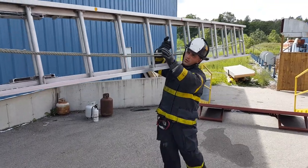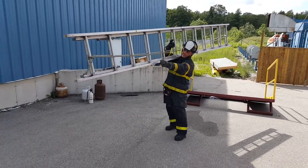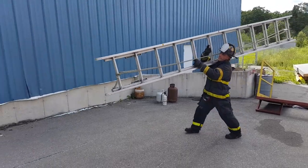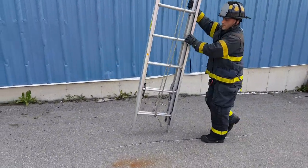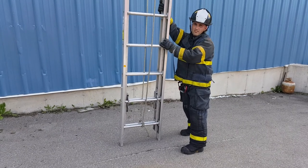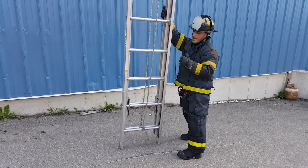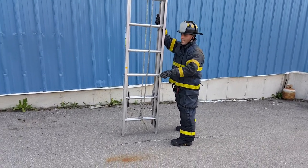I'm going to go towards my building now with the bed towards me. I can now put the butts of the ladder on the ground as I get to my positioning and easily stand it up. Having the ladder balanced in the middle allows me to put it up very easily on asphalt or concrete — on grass it's even easier.